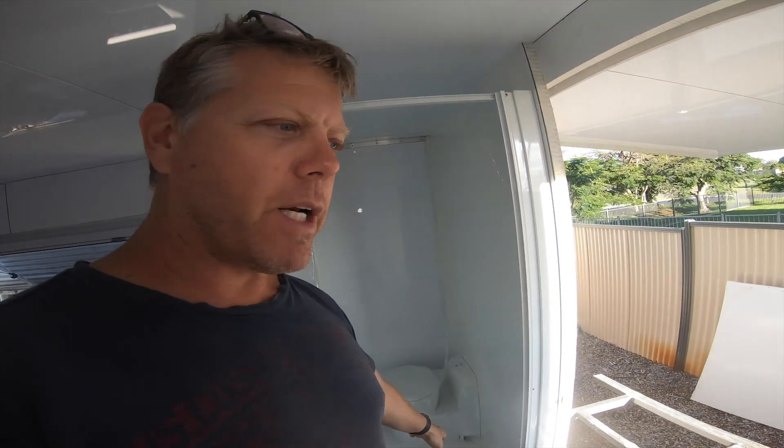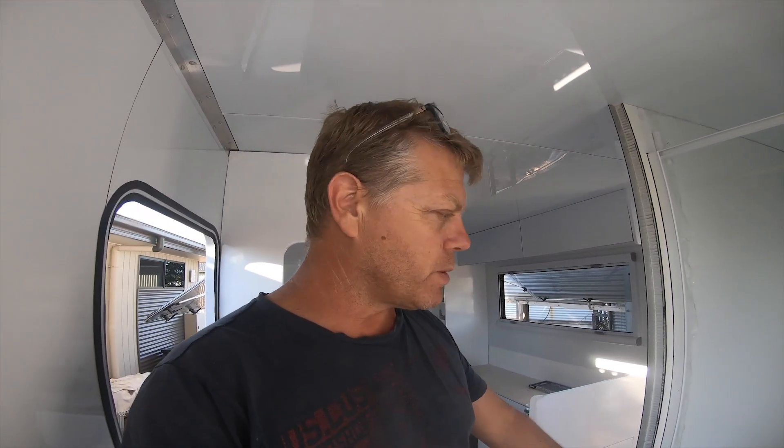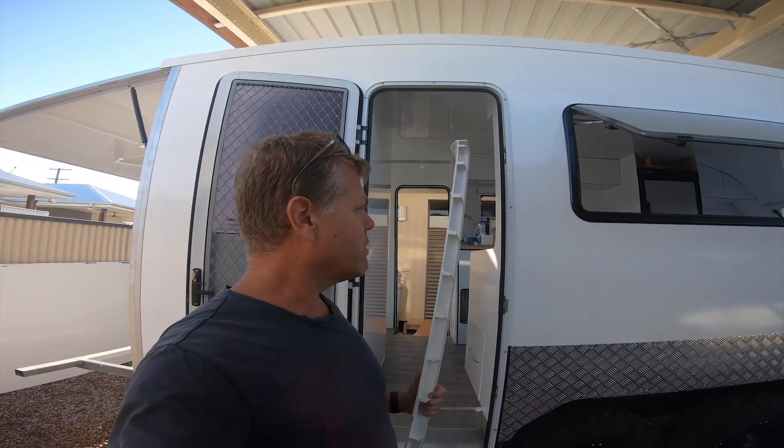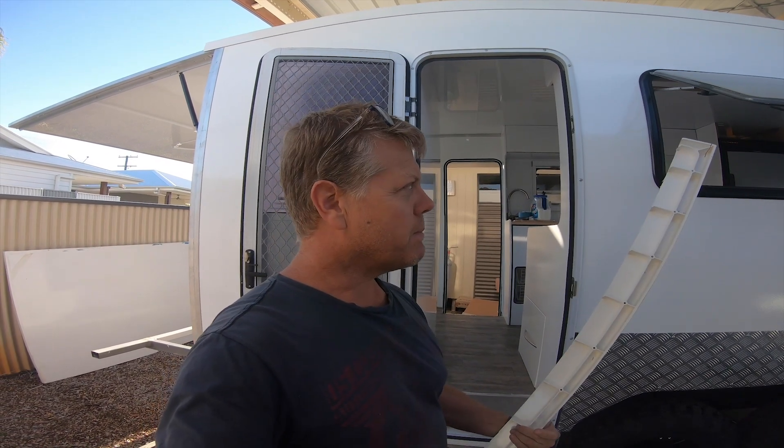Just got to do the top there to make it a hundred percent waterproof. Obviously with a drain, I'll put a shower tray in — a standard 900 by 1.2 metre shower tray which I trimmed down. Trimming it down wasn't too hard. If we have a look here, that is the remaining shower tray — measured it up, cut it with a circular saw and it just cut beautifully, then that just went in.